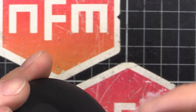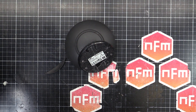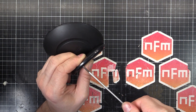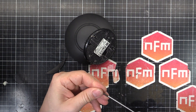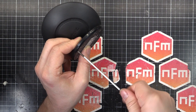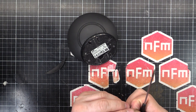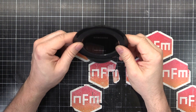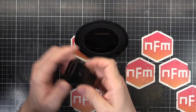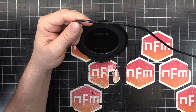With that we should be able to just put the thing back together. Reassembly is the opposite of disassembly, so we just go the other way and we should get it back together. Now there are two screws that are different threads from the rest — well, in this one anyway. The coarser thread I'm putting back in where the USB port is. Okay, we are done and we are ready to plug it in. I've got the official Samsung Adaptive Fast Charging USB charger here. I'll plug the USB cable in and plug it into a power outlet just off camera to the right.